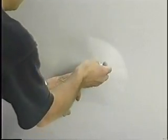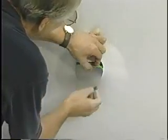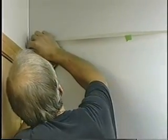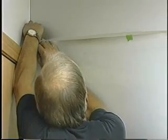Trim all material along floor, outlets, ceiling, and any other areas necessary. Use caution when trimming around any electrical outlet to avoid shock. At the start of the double cut, make sure you open the first 4 to 6 inches of material and then lay it back down gently so you have some air underneath the material. Use a 6-inch scraper and razor blade.